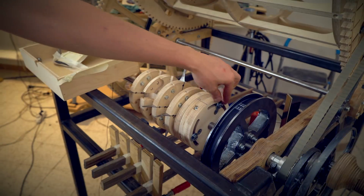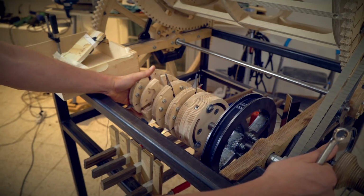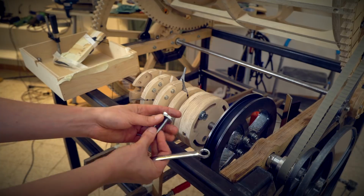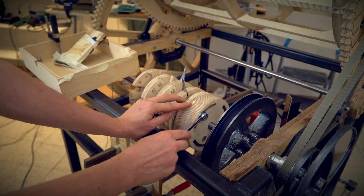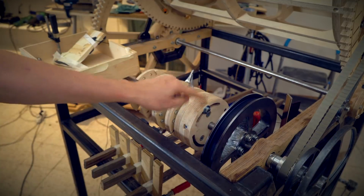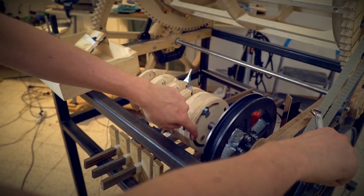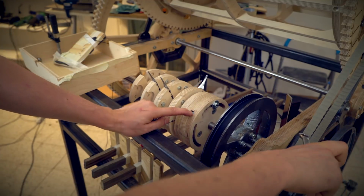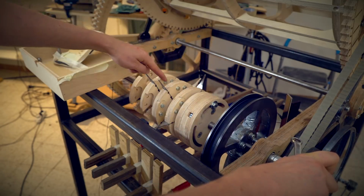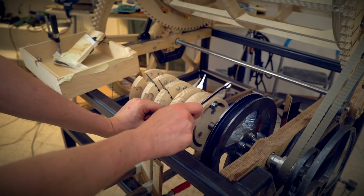Bad news is that the adjustability we have here, which is from here to here, is not enough. I need to be able to turn this more than what these slots allow. I think using 3 of these bolts is overkill. I think 1 of these bolts will be enough, because when tightening this, there's no way this will slide out of position. So if I can just open up the slot here and bury these set screws a little bit deeper, this screw could potentially go around almost 360 degrees. Now it's only a huge project to get this off this shaft.